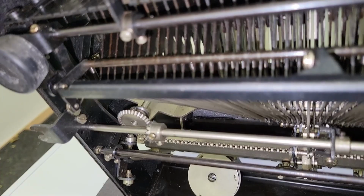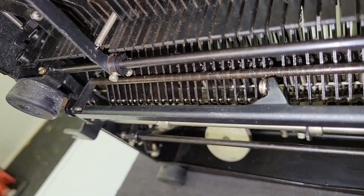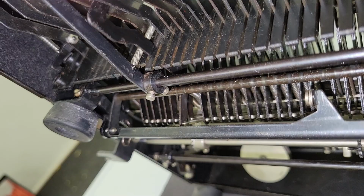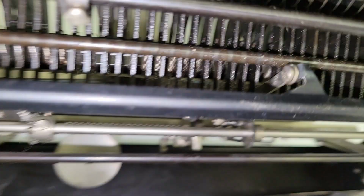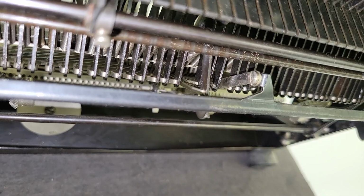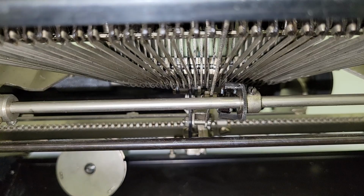So here you can see now those bell cranks of uniform shape and how they actually push against that universal bar, like so. And that in turn, in a class 2 fashion, pulls on that link. So firstly over here we can actually see the ribbon drive.